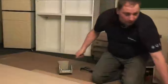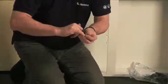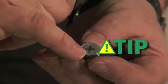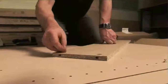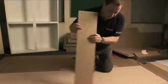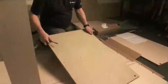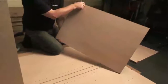Now I put the cams in. The cams themselves have an arrow telling you which way they should be inserted — this arrow should always point to the outside or raw chipboard edge of your panel. Fit the rear support first, put it into position, and tighten the cams as you go. The base panel is indicated by the fact that it has raw chipboard on one side and is only faced on the inside.